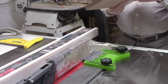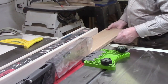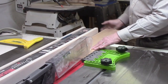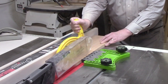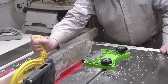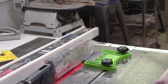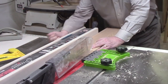I don't have a jointer in my shop, so when I have boards with rough edges I use the table saw to clean them up if I need a smooth 90-degree edge. I have a rip blade in the saw with the height set so the gullet of the blade just clears the top of the board. I always use the blade guard when I can. For rip cuts I like to use the feather board, which keeps the board pressed tightly against the fence before it reaches the blade. You use your hand to exert downward pressure on the board to start, and once the board is fully on the table, switch to a push stick to push the workpiece the rest of the way past the blade. I keep my push stick just to the right of the rip fence so I can pick it up easily as soon as I need it. The safest way to proceed after this cut is to shut off the saw, then wait until it comes to a stop before removing the workpiece.